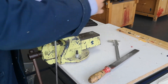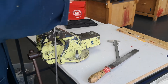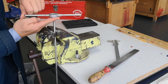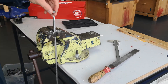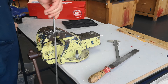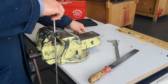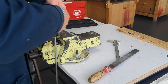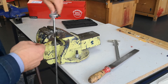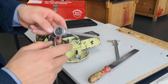You can see all the swarf coming off. Do a couple of full turns forward, back half a turn, a couple of full turns forward, back half a turn. Bring it all the way back, cradle the die stock underneath, and try the nut — still not quite going on, so go over the thread again to clean out all the swarf.